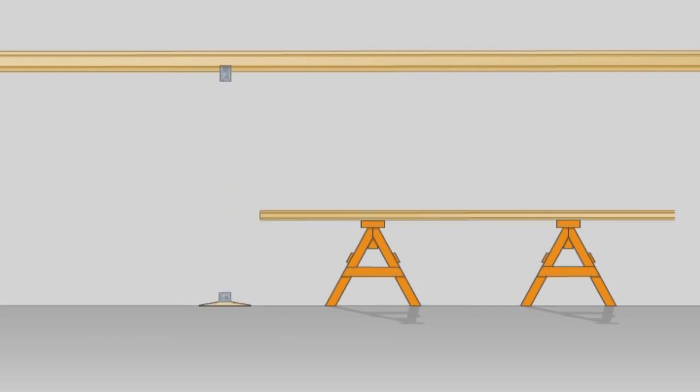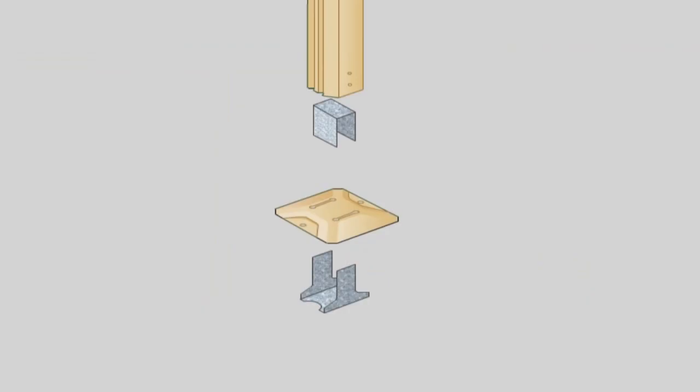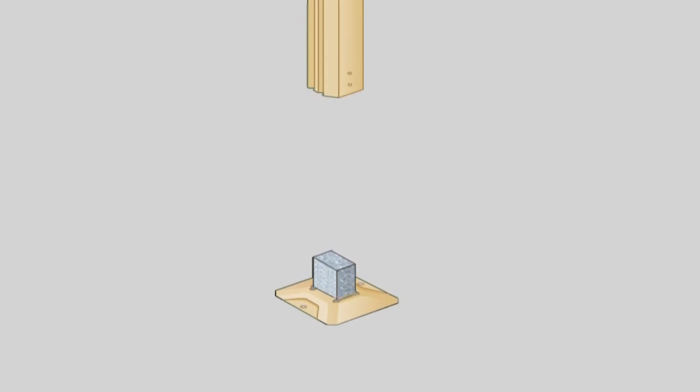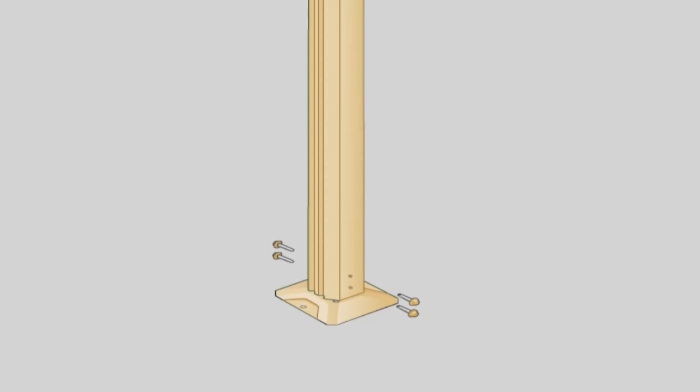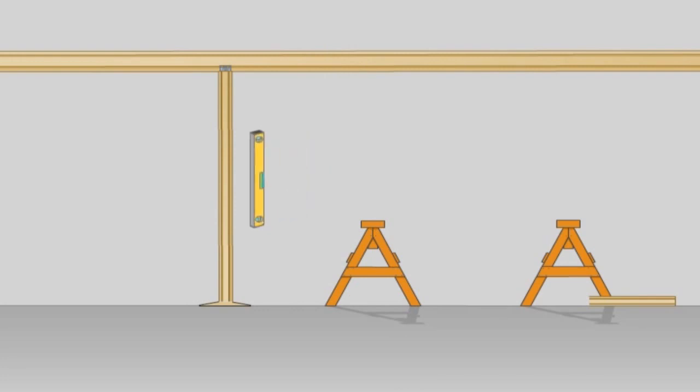Column with attached footing plate. A bolted footing bracket is available if fixing posts to an existing concrete slab. Establish the column lengths by measuring the distance from the underside of the fascia beam to the concrete slab and deduct 20mm to allow for the depth of the footing bracket, then cut the columns to length. Assemble the footing bracket by sliding the legs of the footing upstand through the slots in the plate. The upstand bracing must be located between the legs of the upstand. Slide the assembled footing bracket and bracing into the bottom of the column and fasten with two 12x20 hex head screws either side, ensuring the top screws are located at least 15mm from the top of the upstand with screws being a minimum 30mm apart.